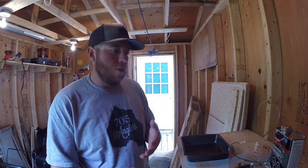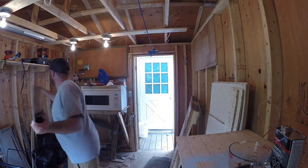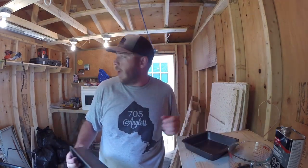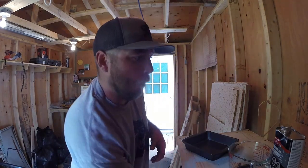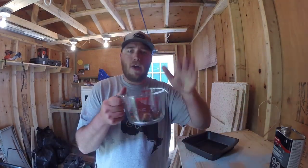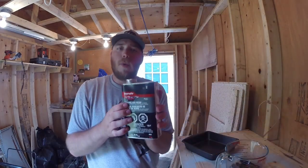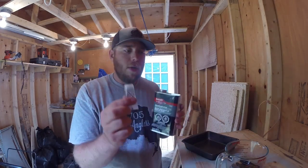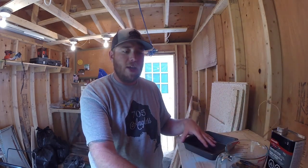I'm going to show you how to make the mold today. You'll need a pan — this is a little bigger than the one I normally use. This is the one I normally use, it's just a Pillsbury pan, costs four or five bucks. You'll need a Pyrex jar — this is four quart — just for mixing your resin. Obviously you want your resin; this is about twenty or thirty bucks depending where you get it. It comes with some hardener. You'll need to know exactly how much you're using. Some super glue to put your baits down, and a spoon for mixing. Very simple.